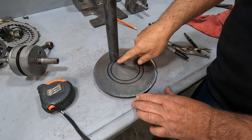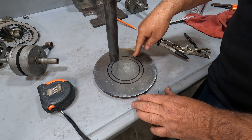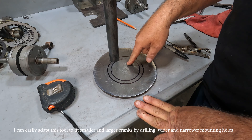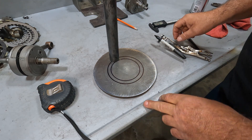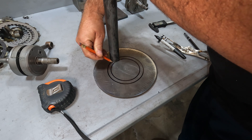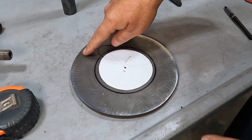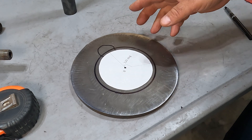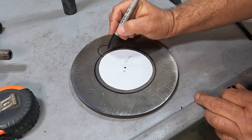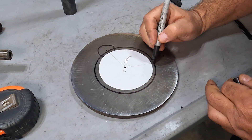This is my plan — I think this is going to be a good spot to mount these. It overlaps this line, and it will open up big enough for the larger crankshaft and even bigger for an even larger one. I generally don't do 80s or anything like that, so this looks like it's going to be a perfect place for this. Since we're going to put three of these rods, we need to divide this 360-degree circle into 120-degree angles, so we know where each one is going to go. We can just download a little template off the internet and print it out — it will show you 120 degrees.